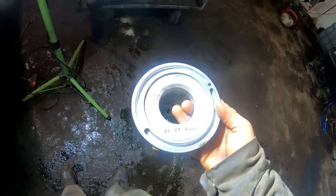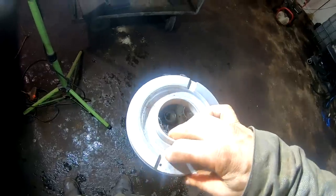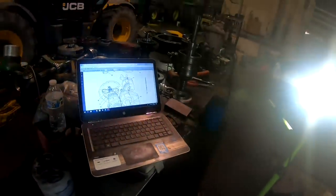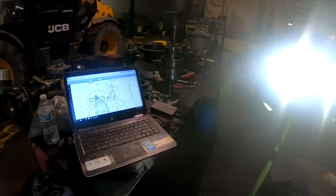I've seen some aluminum pistons crack before and really throw you off. Well, I can tell you one thing. When you go back together, really air check it. And I probably should have air checked the damn thing before I even tore it apart. But anyway, I'll keep you updated on this. I'm going to go home.